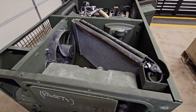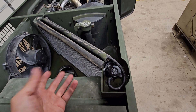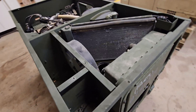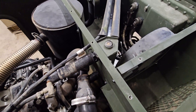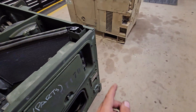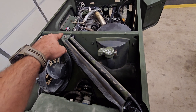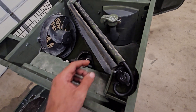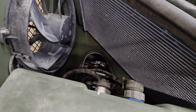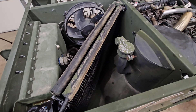New radiator is in — pretty simple. It's a little wet down there; I didn't realize it when filling because there's no hole in the radiator now, so it was just taking fluid slowly and overflowed a bit. Very easy to replace. The most annoying thing is the big hose clamp down there. It's multiple pieces — you take those two 8mm bolts out, same with the ones on the bulkhead, and then it's 10mm on the outside. There are rubber grommets at the bottom and a rubber horseshoe one here — a little deteriorated but they'll serve their purpose.